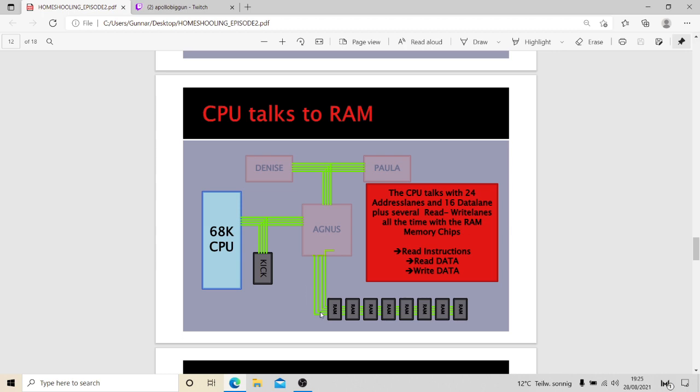If you read a byte, then in fact the CPU will always read a word, which is 2 bytes, and only use the byte you really want of those. So it does not have a possibility to read less than 16 bits in one go.